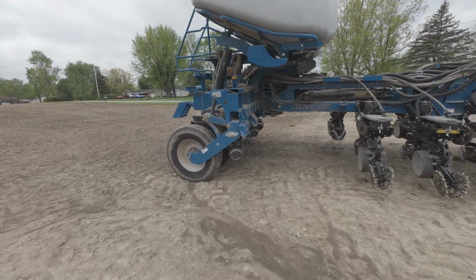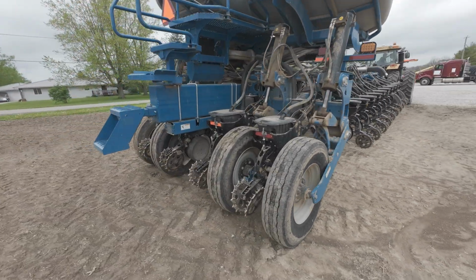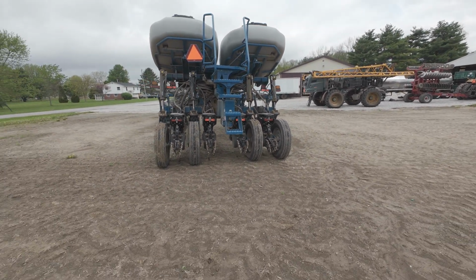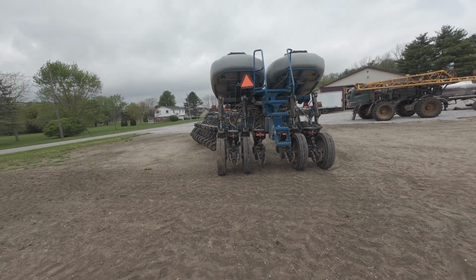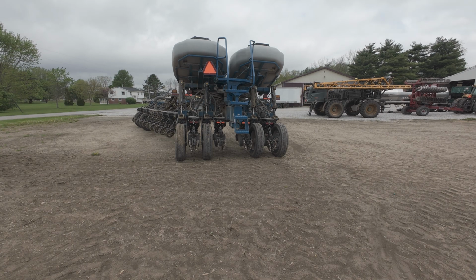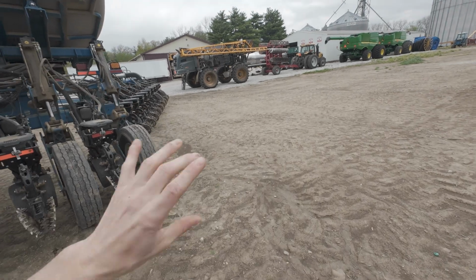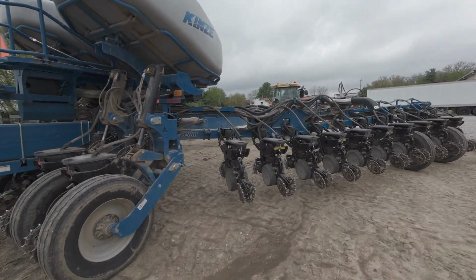He's got a problem with the flip axle back here. It doesn't want to stay in time, and it'll lean, and it does it right when you're trying to leave. Switching valves and doing a few things, just seeing if we can fix it. It also sags in one spot. So there's a cylinder in this system somewhere leaking. The only way to diagnose that's just to switch valves here and there, different places switch valves, or switch cylinders,